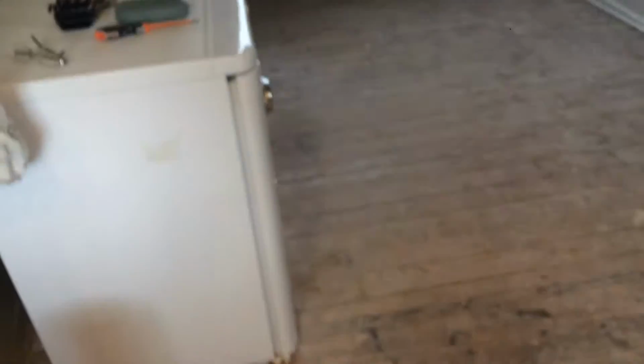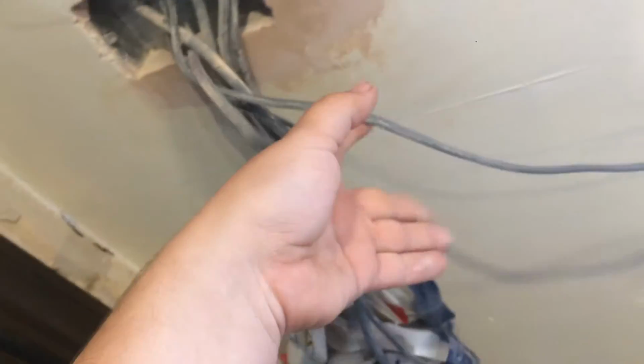But excuse me, in this area you've only got 2, 4, 6, 8 downlights in this bit. I'm toying with the idea of putting another 3 in that bit, because there is a dark patch. Again, this is just running off plug top. There is a dark patch here in this general area. I might put another 3 in, like just another 3 there, but we have got wall units. That's what that cable's hanging out there. It is not live, because as you can see, these are all the connections here that need to be made. The only one that's been made is the one for the downlights.